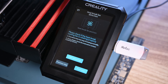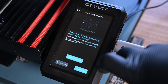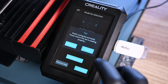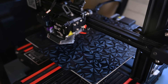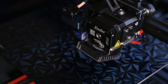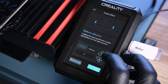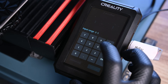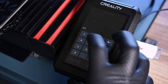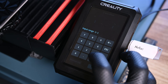The first test is the hotend fan — there is no reason to tap detect as you can clearly see it's rotating when the printer is on. The next one checks the part cooling fan; in my case this caused the fan to run poorly and sound strange, but I proceeded anyway. Next was a homing test — easy enough. The printer goes through the motions and homes the X, Y, and Z axes without much complaint. Now comes the Z offset calibration. I have mine memorized at negative 3.28. Unfortunately, this UI only allows you to enter increments between 1 and negative 1, so I'll need to enter negative 1 three times followed by negative 0.28 to achieve my offset. Strange programming choices.